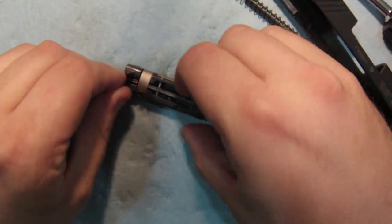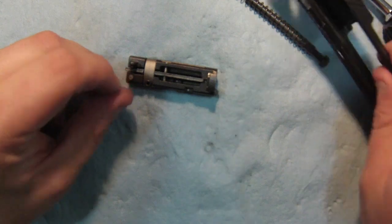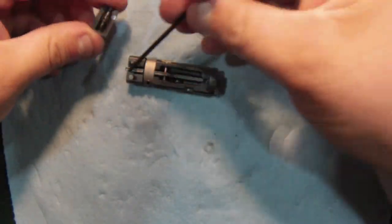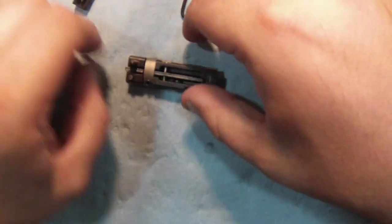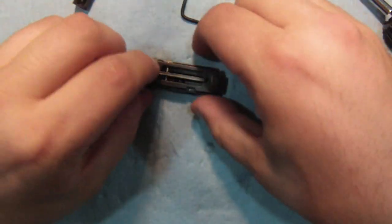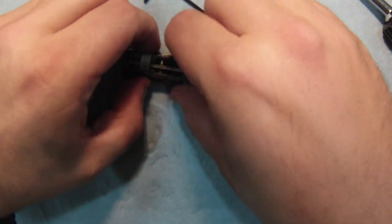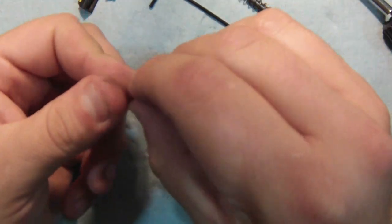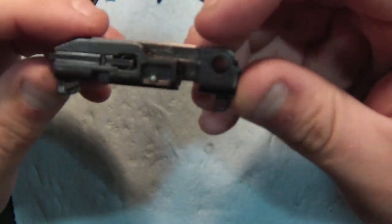Now you've got a breech pin. So this is what, whenever you're actually sliding the safety or the rear sight side to side, on this flat piece right here, the breech pin leaves pressure on that so it doesn't move while you're firing. So we'll take that out. This is the safety block here. It's got a spring. Remove the safety block. And then there's a spring in here for that breech pin, another little guy. So now we're left with the breech here, as you can see.